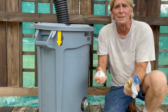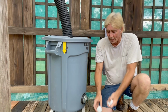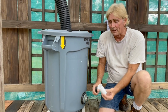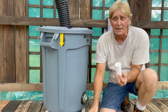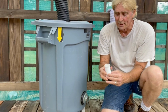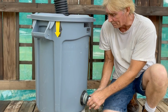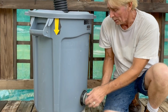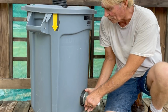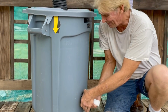Of course, you've probably seen this many times on many other videos, but let's just go through it really quick. So this is the tailpiece from the strainer of the sink. And there's a couple things here that you need. There's a washer that goes inside of it, and you're gonna need the nut to screw it on there and hold it tight. And then it becomes watertight. There's no leaks here. Remember, there's 100 ways that you could make this connection, but we're just gonna make one real simple one here. Let me tighten this guy up. It's been sitting around for a long time.